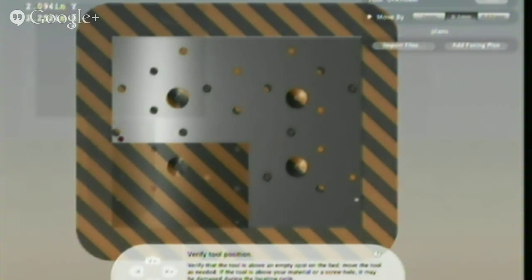and then you hit locate. In case you're wondering what these yellow and black lines are, basically we already told it that we're putting a circuit board down that's 2 inches by 3 inches. That's what it thinks it's on the bed, so it's not going to try to touch off the tool where it knows it's going to go. So whatever band you use, it has to be connected to this. There are ways behind the scenes to manually set the tool offsets, but...